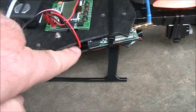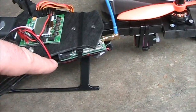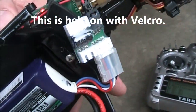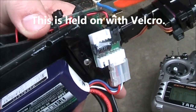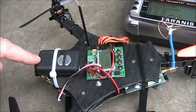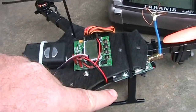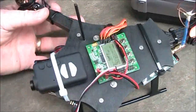The power wire comes out of the video transmitter and it splits. It goes back over under here to the Fat Shark clean power distribution thing, which is connected to the battery. I also cut that wire and ran power up to the camera on the front. And I also ran a video wire from here to the camera on the front, because the camera requires 12 volts to run.